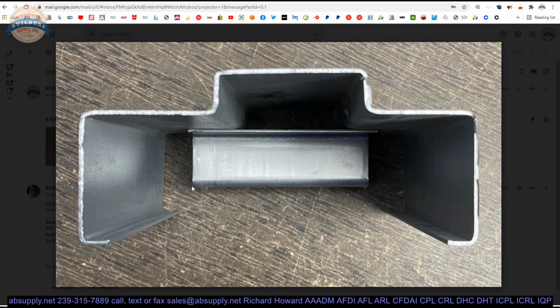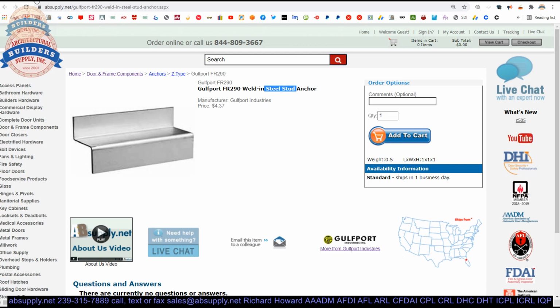We can tell you that if you've got a 2 inch frame, this has a projection of 1 1/4. So you'll always get a 1/2 inch projection of drywall, even if you butt it up to the end of the Z anchor here. Now, be mindful, as your depth changes, so too does the length of your anchor. As your face dimension changes, so should the Z anchor depth as well. If you're doing 1 1/4 frames or 1 1/2, or 1 inch, that's going to all have to be custom made for that. So be mindful not to lose sight of that.